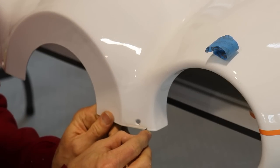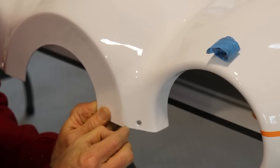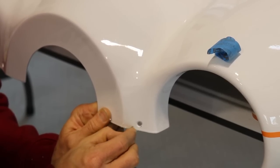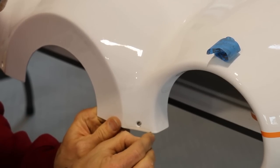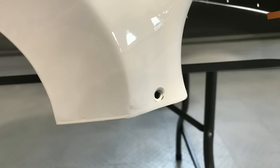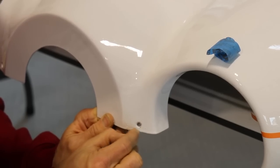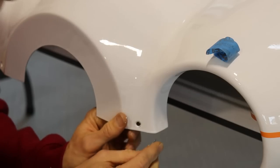One last step with the top cowl before I paint the yellow: I'm scraping off not a run but a little bit of buildup of paint on the very bottom of this part of the cowl. When I painted the white I think I thinned the paint a little too much, or I didn't wait long enough between coats, so the paint pulled up a little bit on the bottom. I'm scraping it off to flatten it out with a razor blade. I would not be doing this if I wasn't painting over this area — since it gets painted yellow I'm just going to try to flatten it out as much as I can.